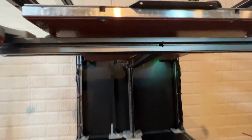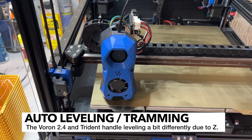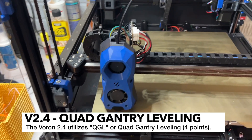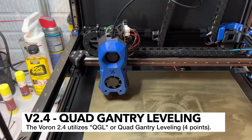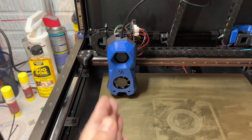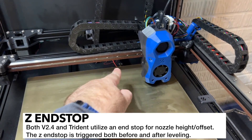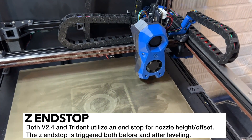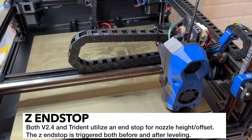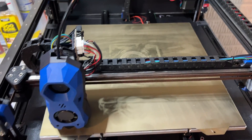That's just enough to create a good plane for leveling. In order to do the auto leveling on the 2.4, you need to run quad gantry level, which goes around to four points along the bed. Both the 2.4 and the Trident stock setup is to have an Omron probe in the back that senses the location between the probe and the bed. Both also have a Z end stop in the back, and before leveling, they use that for the height. So the gantry leveling and nozzle height are done separately.